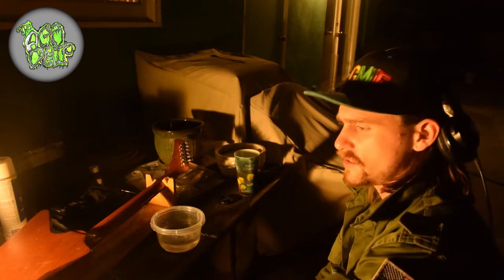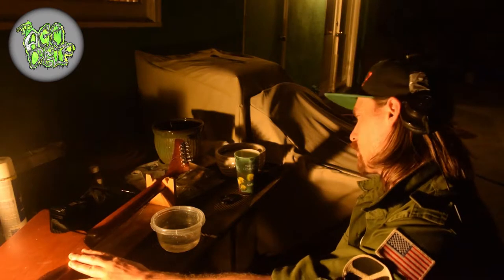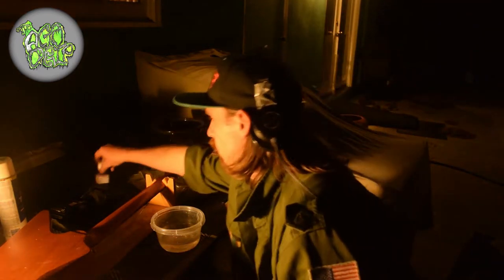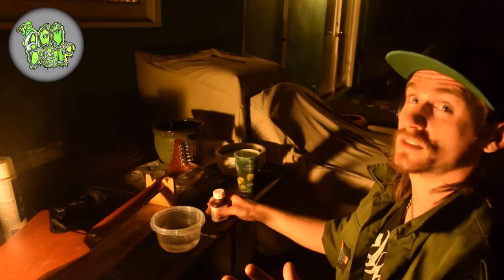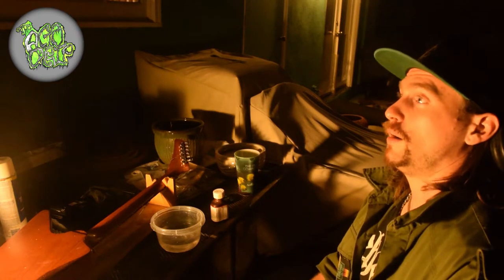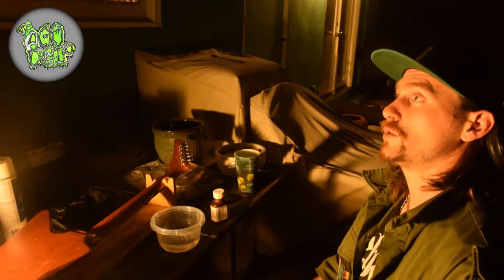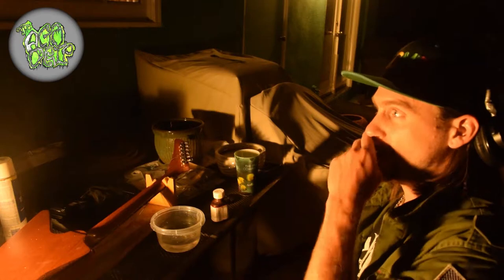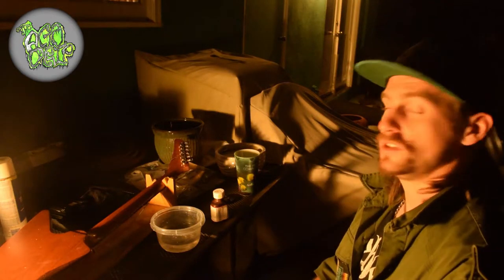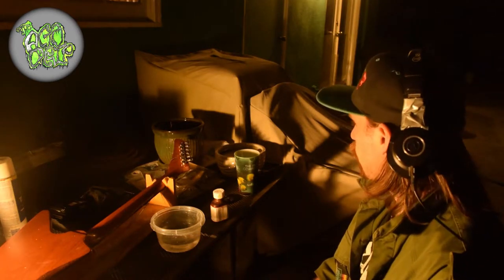If you're going to do a project like this, try to put your guitar outside to dry because the linseed oil - or in this case the Tru-Oil - smells really, really strong, like toxic strong if you have it in a contained room. You have to do it outside, you have to do it on a level surface so it can penetrate the wood and self-level, but you unconditionally have to do it outside. You've got to put your guitar in the shade.